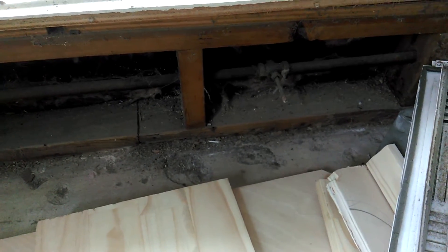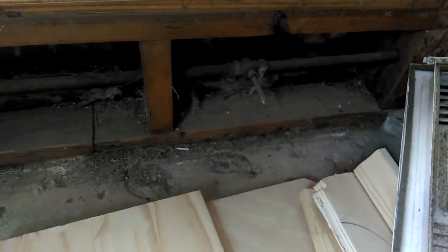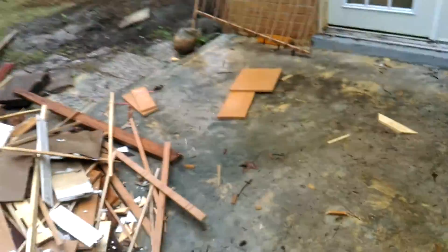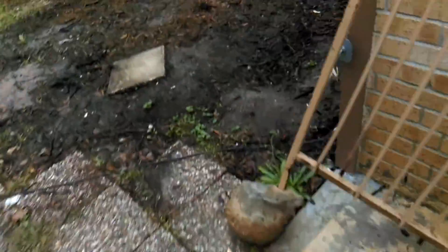This is a half-inch gas valve at this window. We're going to put a French door here, and this gas line running underneath and up top is going to serve a good purpose. This house in the kitchen just has electric, so I'm going to tie into the existing gas line right there.